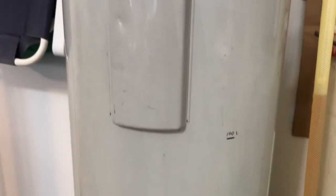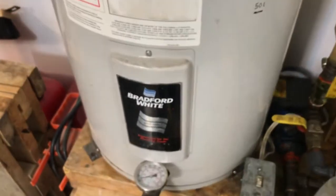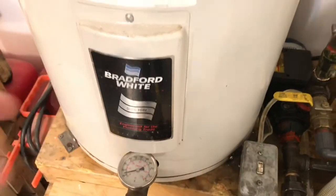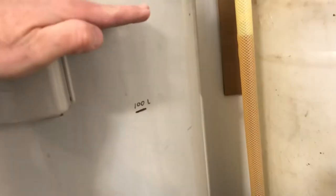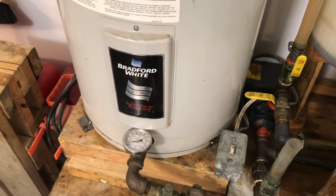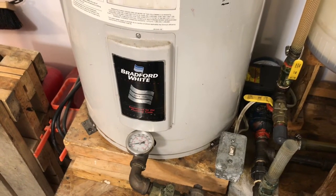This is a dual element water tank but it's only running the lower element. Because the oil is sitting around here and the second element is up here, it just runs the one element in the bottom — it's a 240 volt element running on 120 volts.